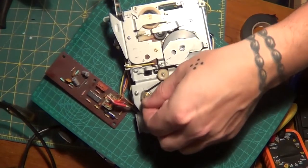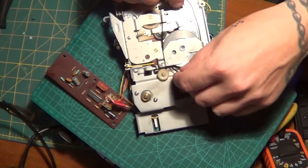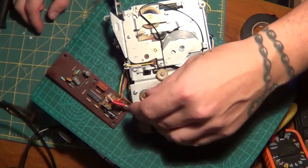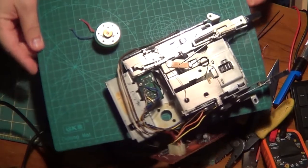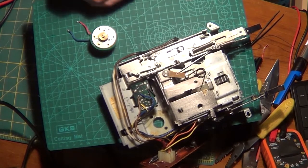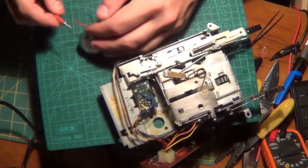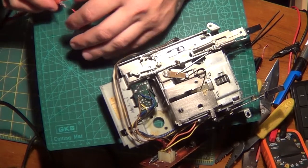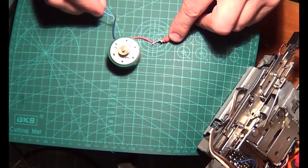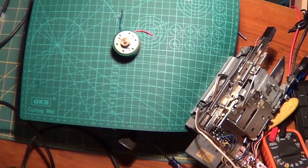And there we have it. First things first, I can take that out of there, and I gotta order a new one. Yeah, I gotta take that out of there. Okay, so that's the motor. Since I have my power supply, I can put 9 volts going into it to confirm whether it's working or not. Let me unplug this thing here real quick. Okay, so here is my power supply. See that? It's spinning. Look. Okay, so now I know it works.